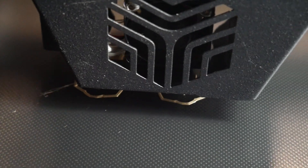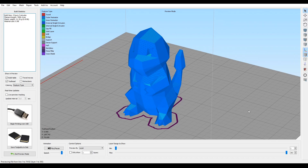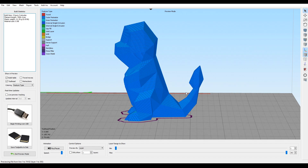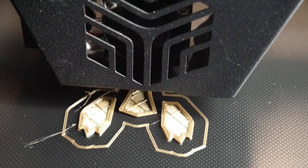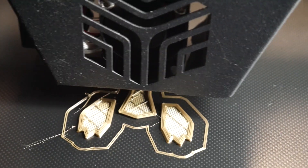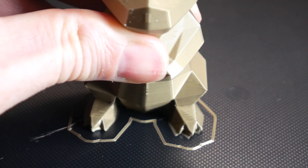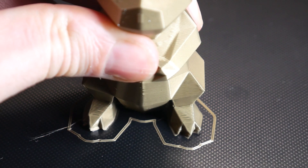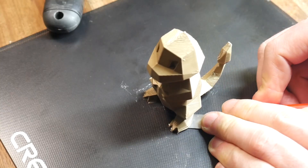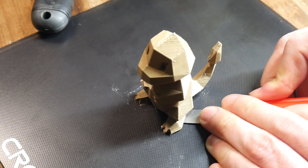One of the questions I wanted to answer was how easy is this filament to print with. For most of these prints I kept a pretty standard 0.2mm layer height. This first one was printed on the CR6 with a hot end temp of 210 degrees and a heated bed temperature of 60 degrees. The print commenced without issue but I would soon discover that temperature was quite important once the print was finished. When the bed was cooling down I couldn't remove the print — the lower portion of the model had stuck extremely well.